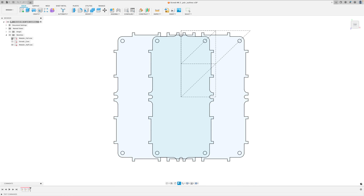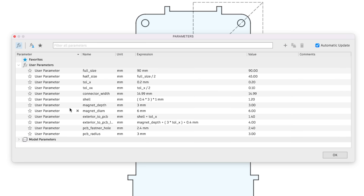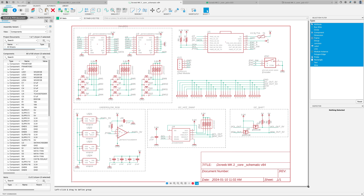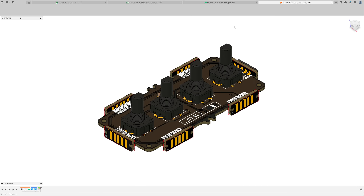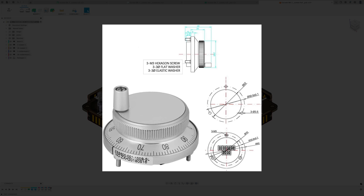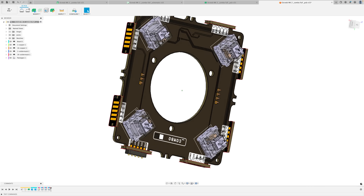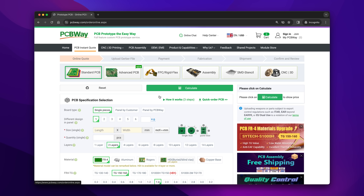The first thing I did in this step is make these main sketches to derive the board outlines from, giving an easy way to update and tweak shapes down the line. Everything from the pogo pin height to the magnet thickness affects these dimensions and I will be referencing these geometries throughout the entire design process. I laid out five boards in total: the main macropad core with six possible attachment points; a four-rotary-encoder module called Dials; one with two slide potentiometers called Faders; another with three switches and an encoder called Combo; and a funky one using a big 16mm CNC encoder and four switches. I double-checked all the files including the two tiny connectors and sent all of them to PCBWay.